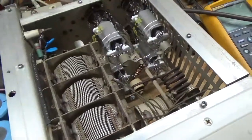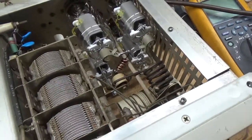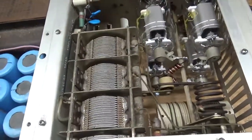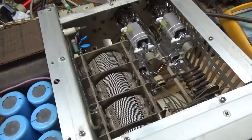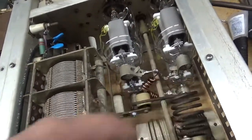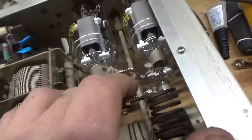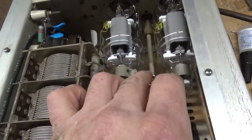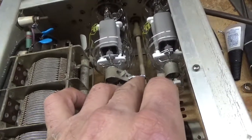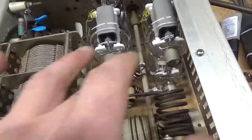The old parasitic suppressors were shot — here's one of them; the other looks similar but a different type. I had to replace the straps. Someone had soldered them together and they were very frayed. I ended up stripping some coax to get shielding material of the same diameter. Where they clamp at the end of the anode connections, they snapped when I pulled them apart, so I re-crimped them really well and soldered them nice. The lead lengths are nice and short now — before they were super long.